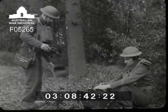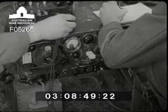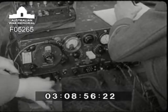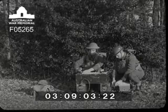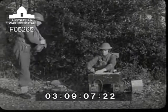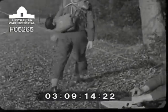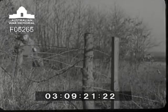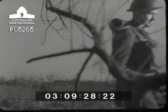The next job is the remote control. Operator two brings a control unit and cable over to the set, and with as little interference to the operator as possible, he connects it up: line, phones, key. He clamps the first drum of cable to the connector and then loads up with all the gear which he will need. A battery clamping rod makes a very good spindle on which to roll out his particular barrel. On his way to headquarters, he takes care to lay the cable where it will be safe — it so often happens that a length of cable is ruined when it's been thoughtlessly laid where it can be fouled by transport, and particularly by tracked vehicles.